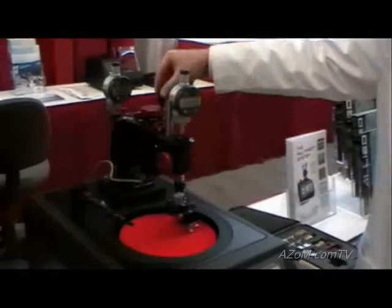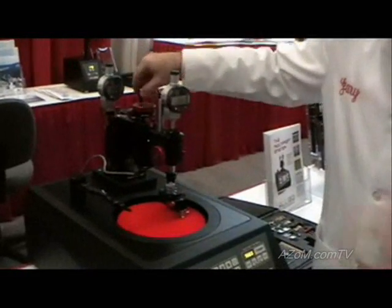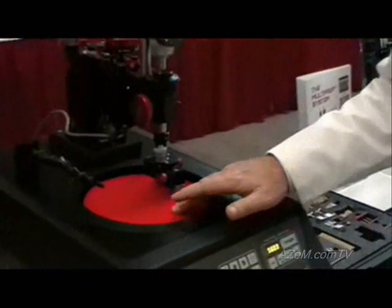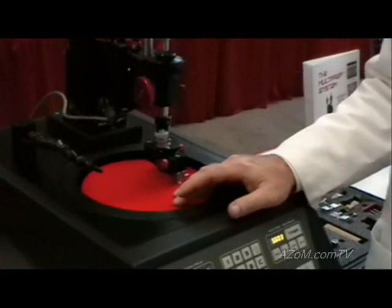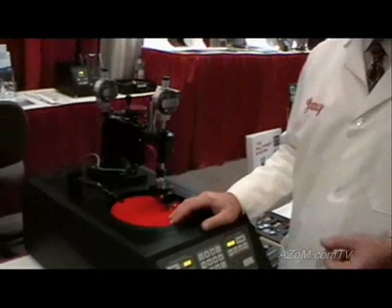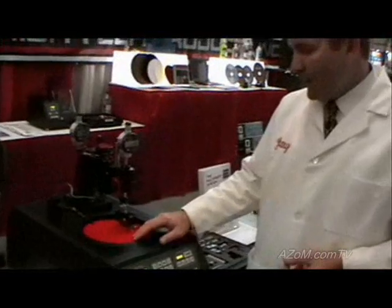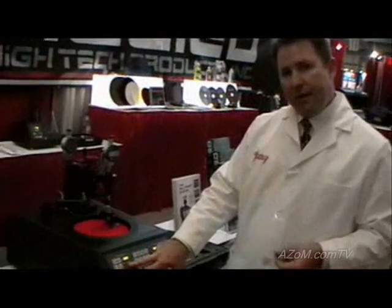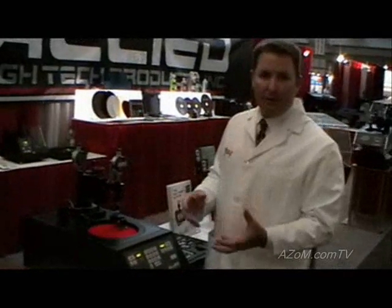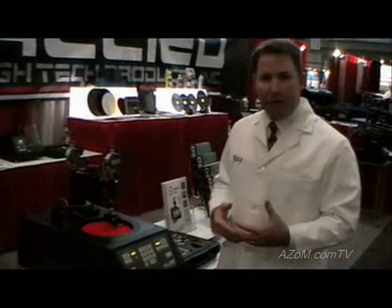The sample is essentially advanced into a moving or stationary grinding wheel. In this case this is a polishing cloth surface, but lapping films and abrasive discs of different sizes can be used according to the material and the surface area that you're trying to grind. A variable speed option on the polishing machine allows you to accommodate the requirements of different types of abrasives, with variable speed RPM of 5 to 350 RPM.